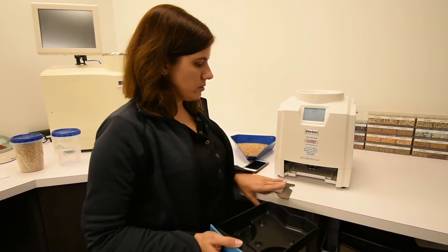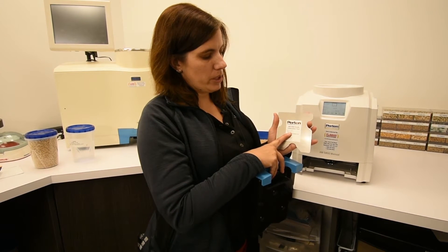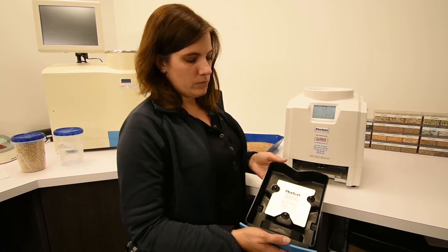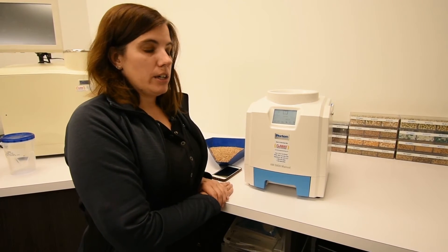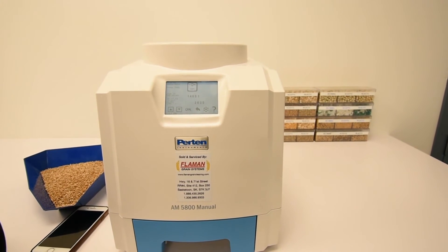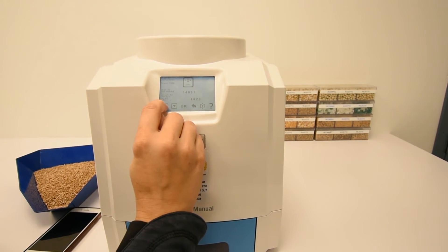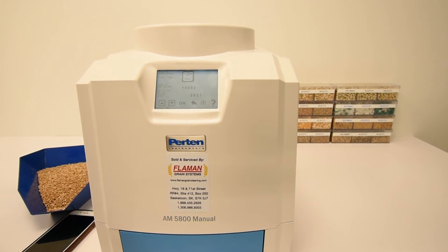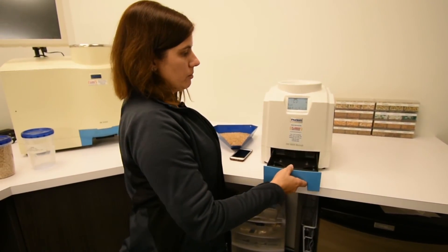Once that bottom number is at zero, you will put your plate in the drawer. You want to make note of the weight on your calibration tool — this one is 262.7 grams. You will place it in the drawer and place the drawer inside the unit. The scale inside is weighing that weight and the bottom number will display what that weight is. Currently this one is reading at 262.0. You can use these arrows to go up and down to change it to 262.7. It can be within 0.2 or 0.1 — that's okay. When you're satisfied with that number, you hit OK and remove the plate from the drawer, and you can begin your test.